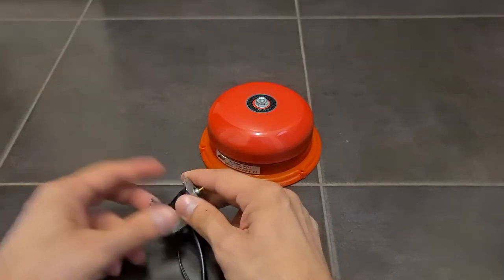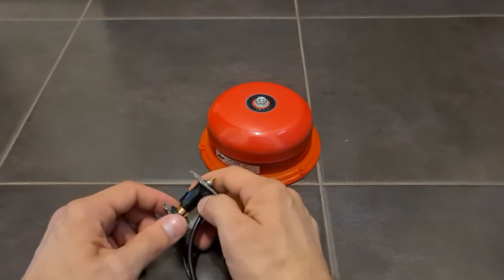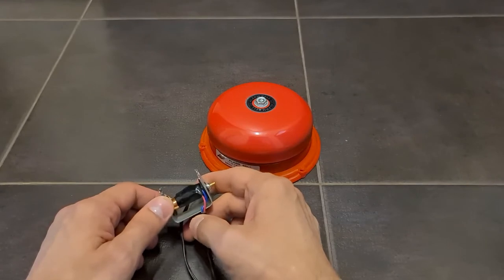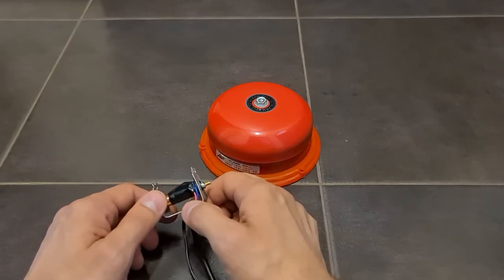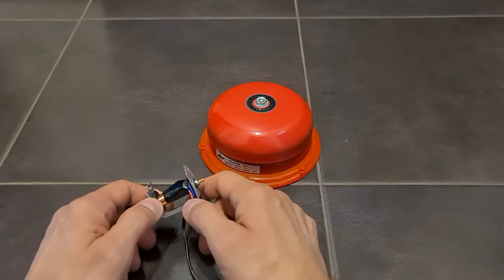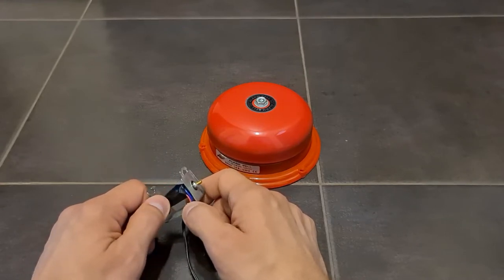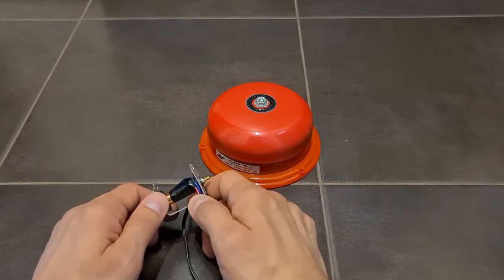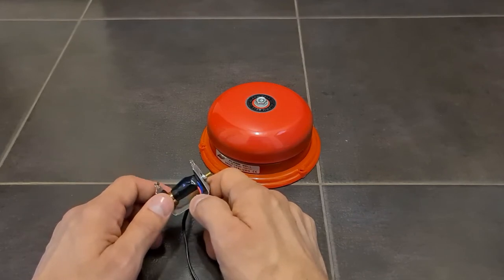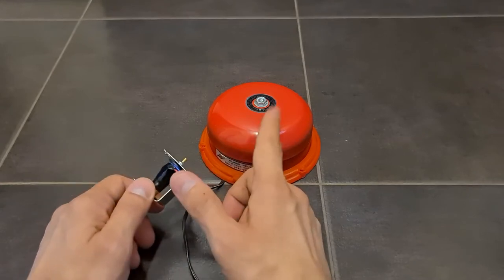So to make it work still at 220V, but also as a phone ringer at the voltage going on there — which is from 70 to 90V AC depending on the country. It just has to work with that sine wave of 70 volts, and then it should not create problems with the DC signal of the phone, which is minus 48 volts, maybe minus 50 in some countries.